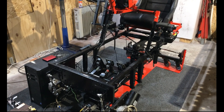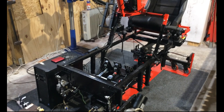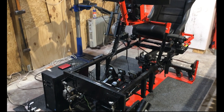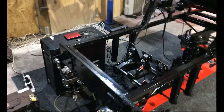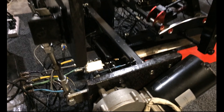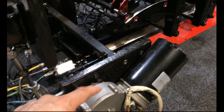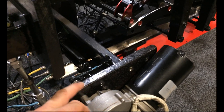I don't do that because grounds are grounds, and electricity is always going to earth. I think you'll just end up heating up your motors if you try to isolate the grounds. This is a simple, effective, proven way to isolate your motors from each other and your frame — and it works. My sim has been used this way for over 12 months, gets smashed, gets rigorously put through its paces, and the hardwood timber is well and truly up to the task. The material I use to mount my motors is a hardwood Merbau timber decking — 20 millimeters thick and 140 millimeters in width, cut to the size I need.